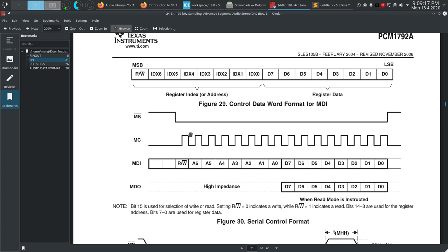On the first clock pulse, the read/write or most significant bit gets sent. Visualize it by fixing the data line and moving the clock line left — the first bit being pulsed is the most significant bit. The data going back also follows this same order. So the most significant bit is the first one sent because that clock pulse happens before the others. In my experience, most SPI peripherals use MSB first, though LSB first does occasionally occur.